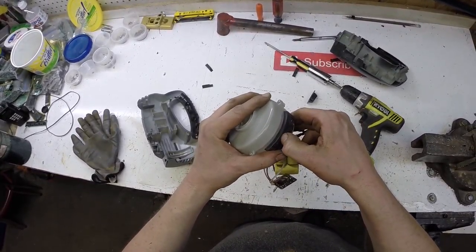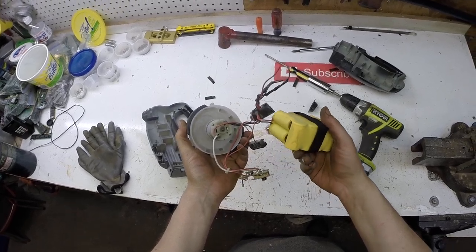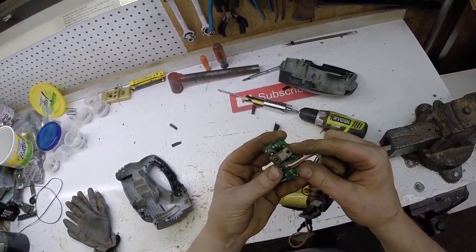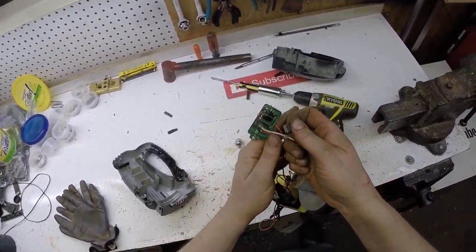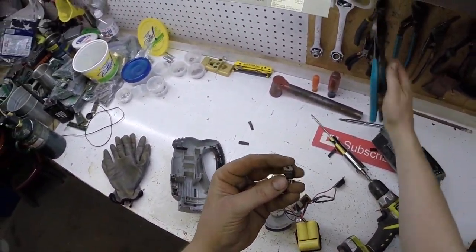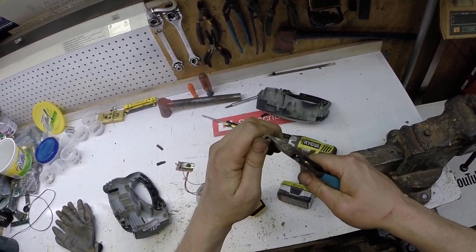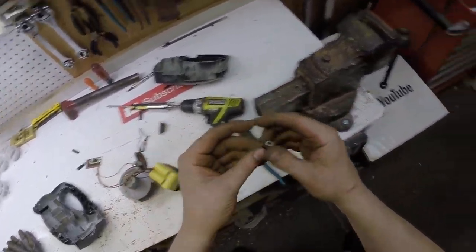All that mechanism — that's for vibration dampening, that's just rubber. All the mechanism in there is all plastic. Not much to this thing. Oh look at that, the circuit board is cooked. Look how discolored that is. The little MOSFET here failed — the transistor. Look at that. So that's a little piece of copper, a little piece of number two copper. This metal plate that's in the transistor — this is just plastic on there, but that metal plate is copper. Take a little nip into it. See? That's copper. This will go right in your number two copper bucket.